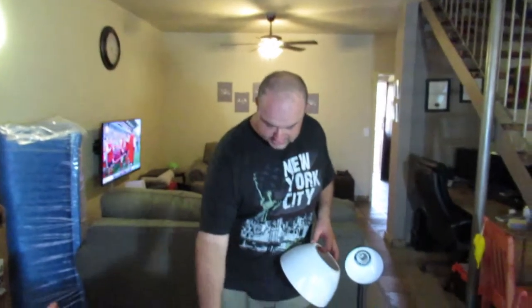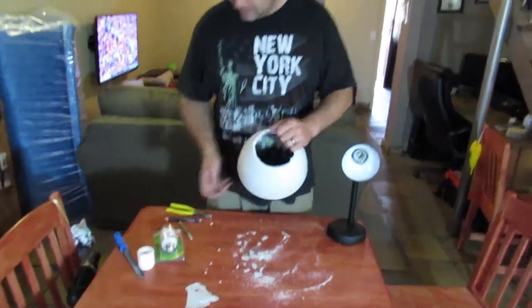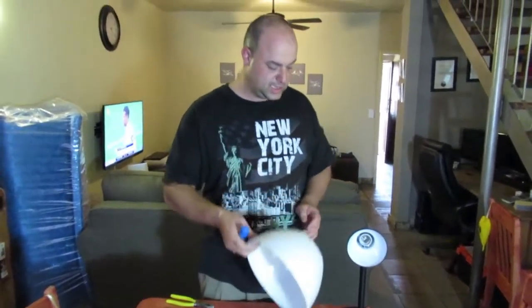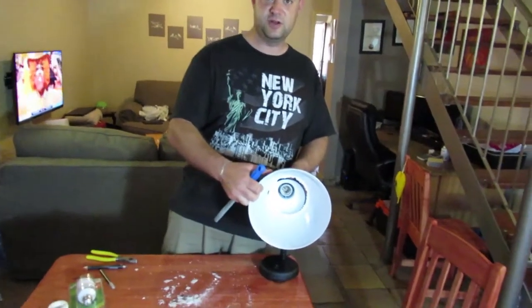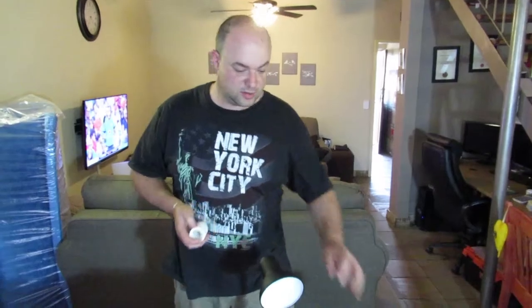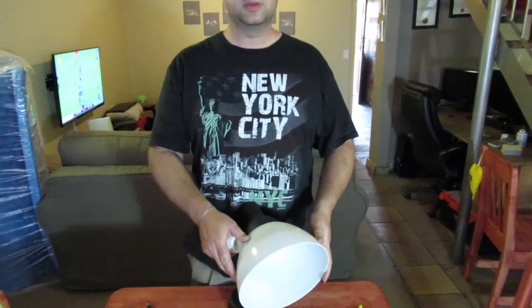You can see all the mess of what came out the bottom of the bowl. So now what we're going to do is use our half-round file to slowly file the edges smooth, keeping the gap in mind so that it can just fit over the top of the light. You don't want it too loose otherwise it's going to simply fall out the back. Once you've finally got your edges filed out and it just barely fits over the light, you're ready.